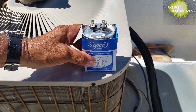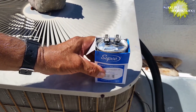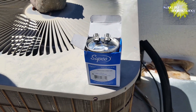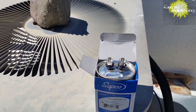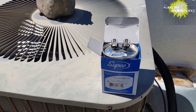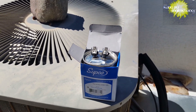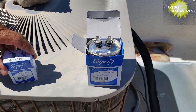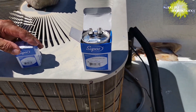I don't know if you guys know this or not, but there's actually a safety built into the capacitor. If it starts to fail really bad, it pops up on purpose. The reason it bulges up is to disconnect the leads from the plates inside so it's no longer transferring energy properly, and it doesn't cause more of a situation. It doesn't always work out, like it didn't necessarily here, but that's the design in capacitors.